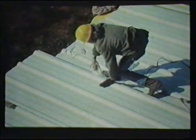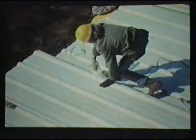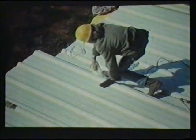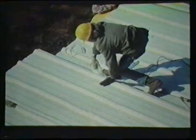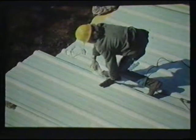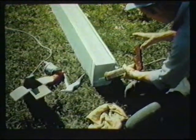Double to single sealant thickness transitions should be accomplished by butting or feather edging. A tape sealant should not be stretched during application. Remember to remove the release paper just prior to panel nesting. The end result of an installation mistake will be a faulty lap seal and a costly leak. Tube caulk should be used per drawing specifications and as necessary in accordance with sound erection practice.